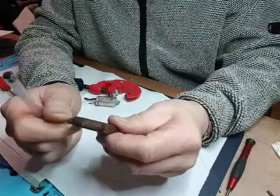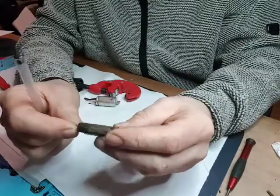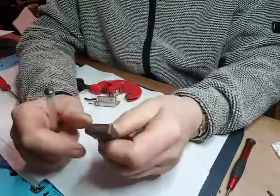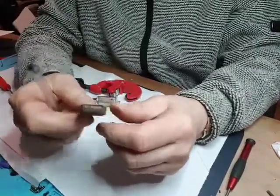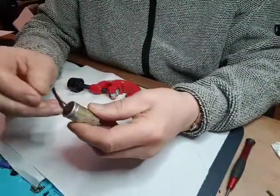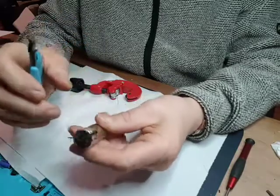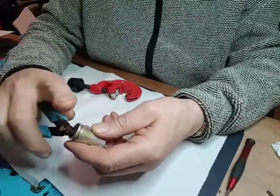These are part of the mains filtering. As the mains comes in, these are on the input side. Now, whether I go for this idea or use a more modern inline filter with the kettle plug type, I think I showed you a little plug before, but you can also get them with built-in filters. So this is the 0.1 C91, quite sharp ends. It was originally colored red and black as if it was polarized, but I don't think it's polarized, not at 0.1.